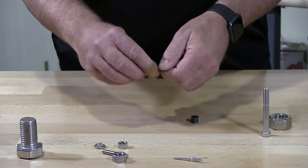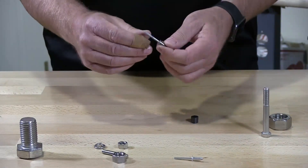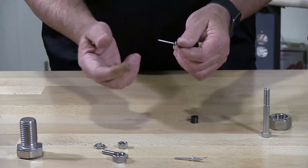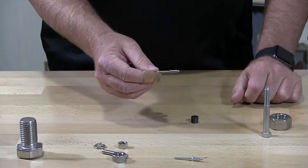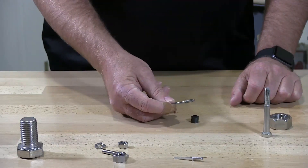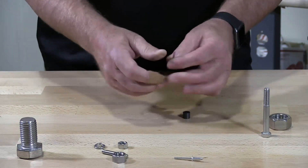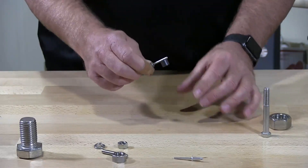This is a rivet — stainless steel, 304 stainless. This whole rivet is worked, and the whole crystallization of the stainless has been changed — the whole structure. I'm going to demonstrate that this will show up as being highly magnetic. There it is. That's the hat part, and this is the mandrel. All magnetic.